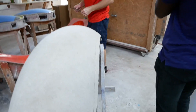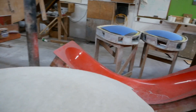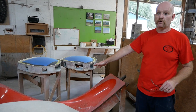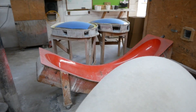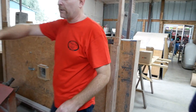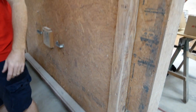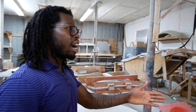We have two different ovens. That, believe it or not, is a big giant toaster oven. It gets dropped on top of this tool — we put a piece of acrylic in, drop the toaster on top, heat it up to about 220–240 degrees, then pull vacuum on it and suck it down and cool it. It turns into one of our windshields. Or in this other toaster, we put acrylic in and they turn into droopy pieces, put them in these tools, and inflate them to make doors.